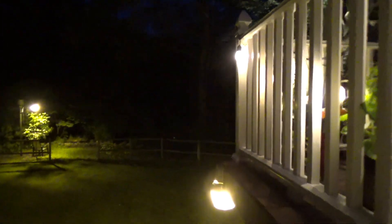The uplighting has broken — only one of the bulbs is operating, ironically the bulb that was put in weeks before the other one. I did already check the bulb; I swapped it into the other light fixture and it still doesn't work, so there's something wrong with this fixture. I have a hunch it might be some kind of water damage because the bulb necks do not make a good seal around the socket, but the other one has lasted through multiple rainstorms with no trouble.